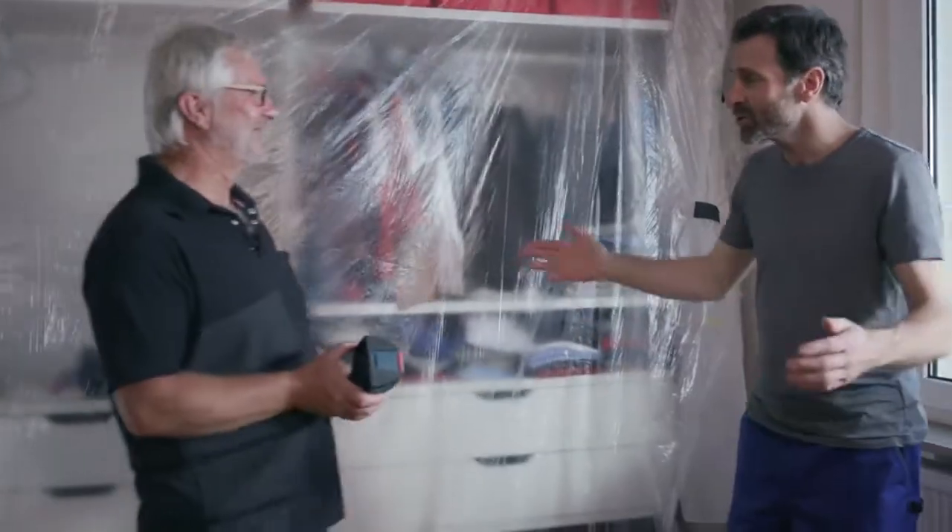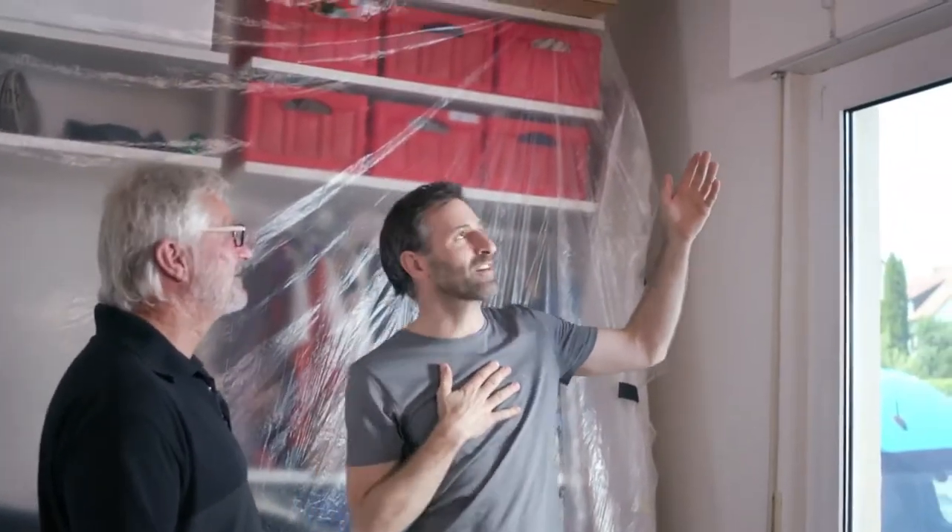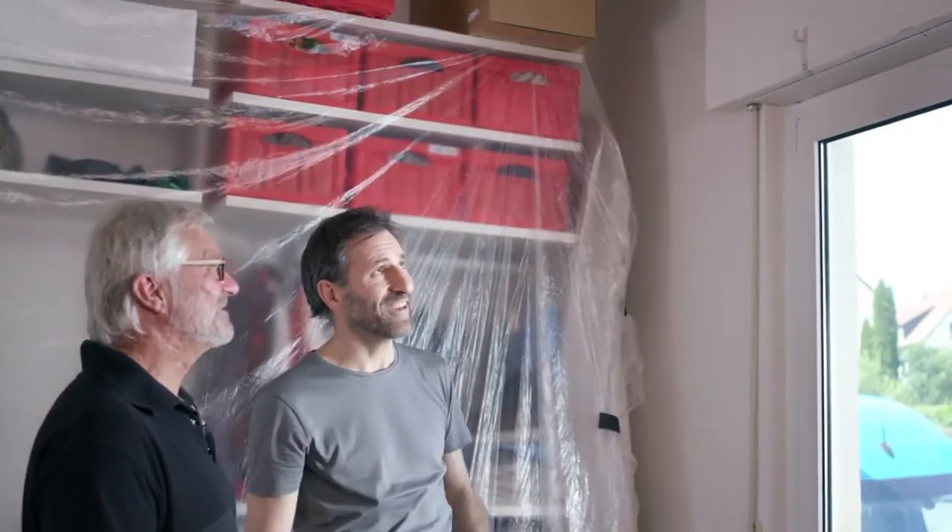So Joachim, we're looking to modernize the whole house, so I need to check every room for thermal bridges, to make sure that the radiators aren't emitting heat for nothing. And in this room here in particular, I reckon that the old roller shutter box is going to be a problem area. However, I'd need some proof of this to show my customers. Perhaps you could help me here. That'll be our first use.